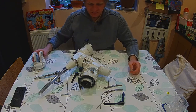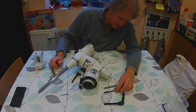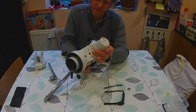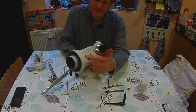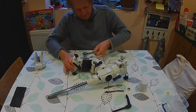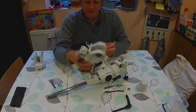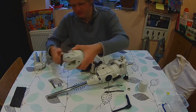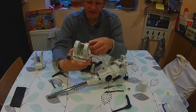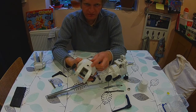The first thing I need to do is unscrew the base here. So what I need to do is drill out this part of the mount with an 8.5mm drill bit, which will enable me to tap the new thread into there for the M10. There's the base, and the M8 one is in there, so I'm just going to unscrew that. Now all I have to do is drill that out with an 8.5mm drill and then tap it with the correct tap. Let's go and do that now.